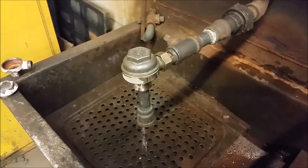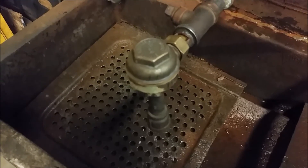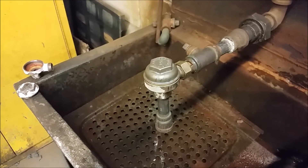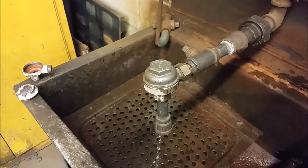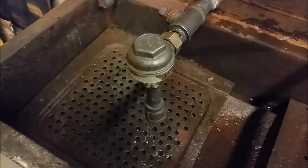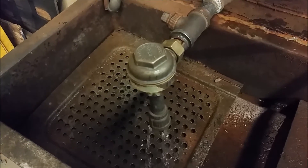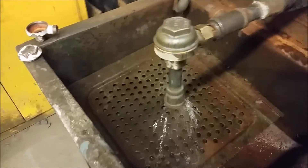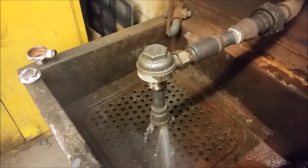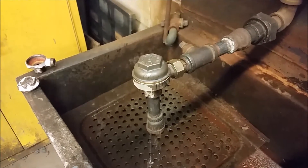Let's get a little water here. It is draining. This is what it's supposed to do, but I'm trying to get it to blow so you can see how it seals up again. There we go. So that's sub-cooled, and then it's sealed up again. That's typical of all of our traps.